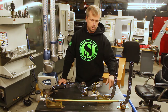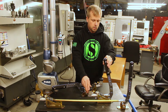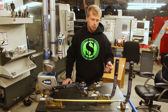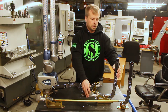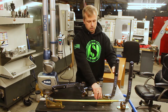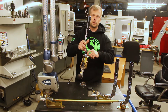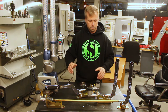We also machine all the components in here. There's a machined axle that the handle pivots on with bushings, giving it a real smooth, crisp feel you just don't get from any other handle. Typically competitors run a steel bolt or steel pin through the handle — steel on aluminum — and after one season of drifting it gets floppy. With ours it's rock solid. There's a polymer bushing inside that's basically going to last forever, so your handle will never be flopping around.